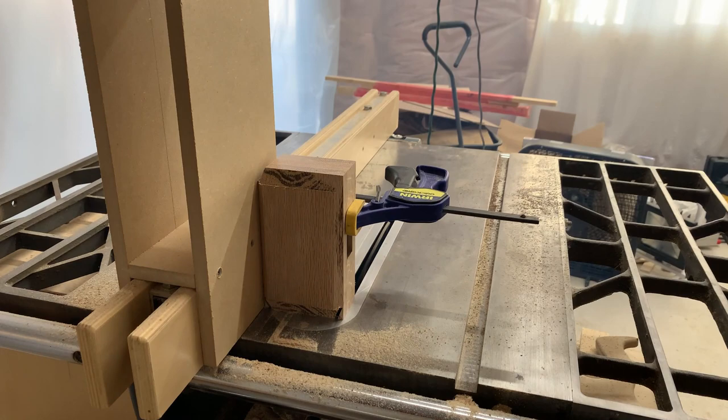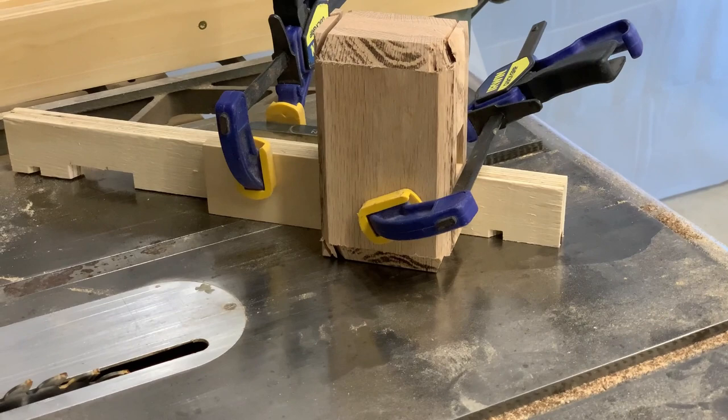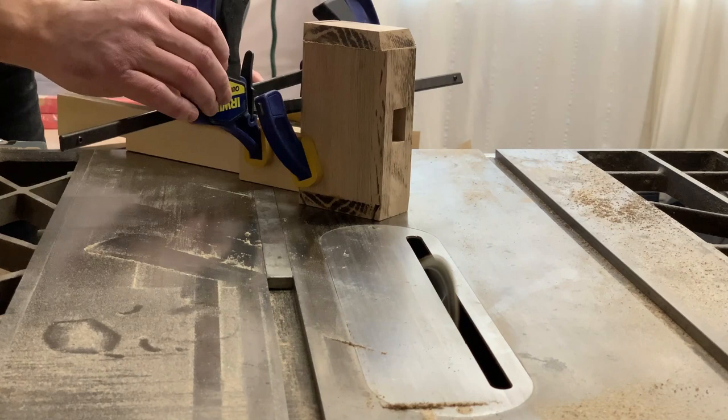After getting the basic chamfers cut, I decided to take a stab at a compound chamfer to ease the corners from the sides to the top and the bottom. So I rigged up a setup to get the head turned to 45 degrees, while keeping the blade at 60 degrees. It ended up not being perfect, but it added a nice look.